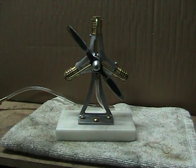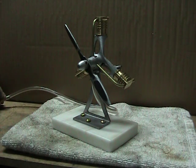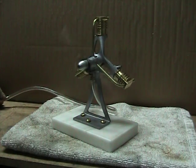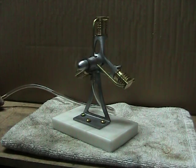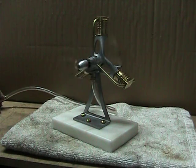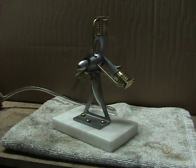I'll start it up and we'll see how she works. First we'll take it down to kind of a slow idle here. That's about as slow as it'll go. The spring-loaded ball valves in there require a fairly substantial amount of air from the inlet to push them to the side, so this engine typically won't run on anything less than about 15 to 20 psi.